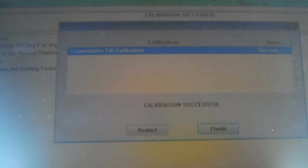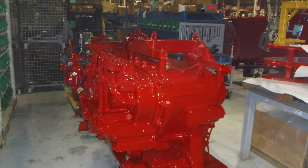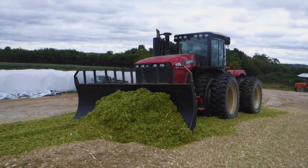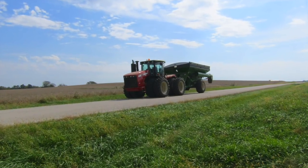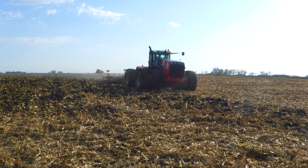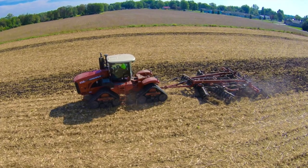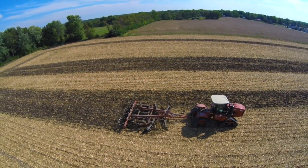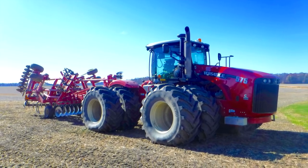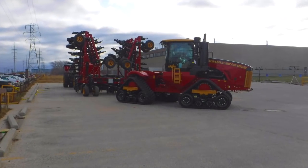There we go — calibration successful. Just hit finish and you're good to go. The procedure is the same for all versatile four-wheel drive tractors. The 450 and up through all the big ones use the CAT TA-22 transmission. The smaller versatiles — the 350, 375, and 400 — use the CAT TA-19 transmission, and calibration is still done the same using the CAT ET tool, though some clutch configurations and calibration order differ slightly. The CAT ET tool does a lot of good things and helps you see the history of the transmission. I hope this video helped — thanks for watching.